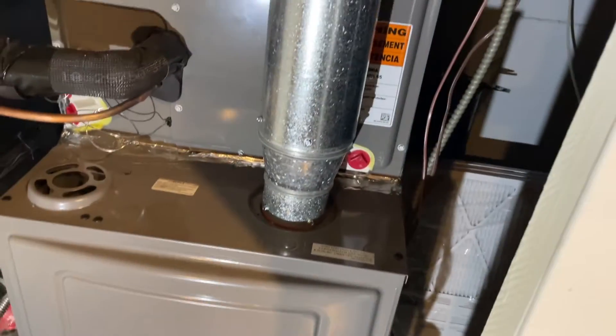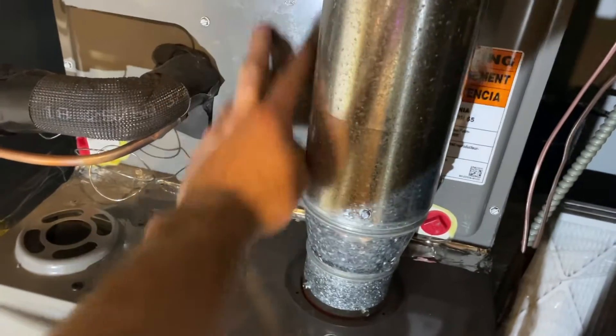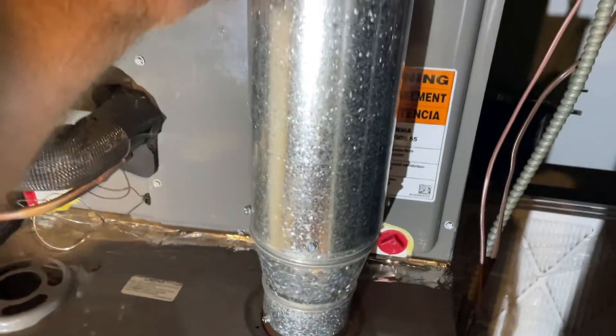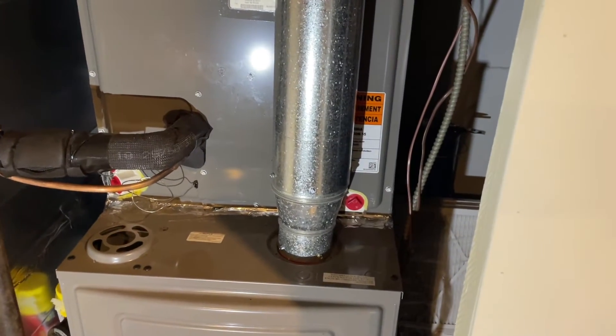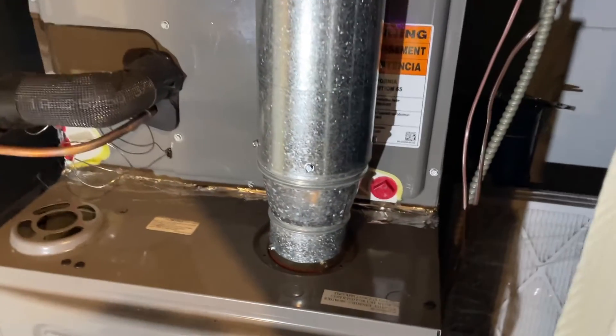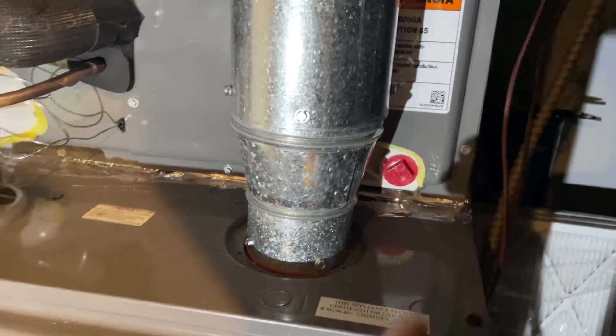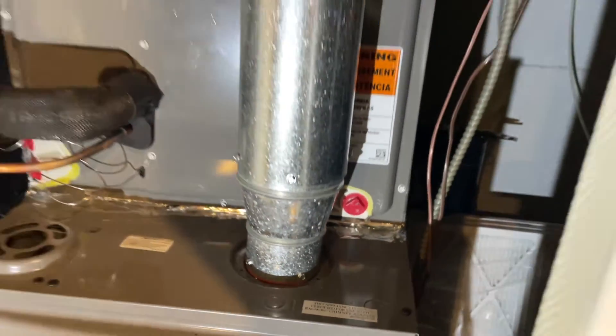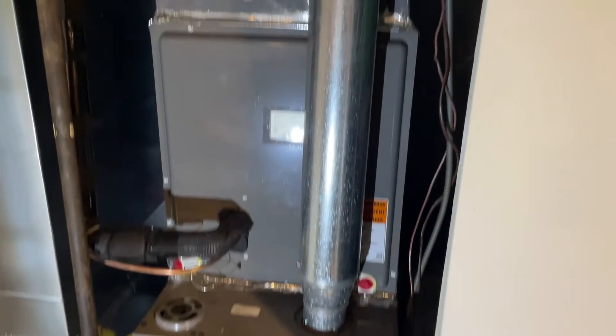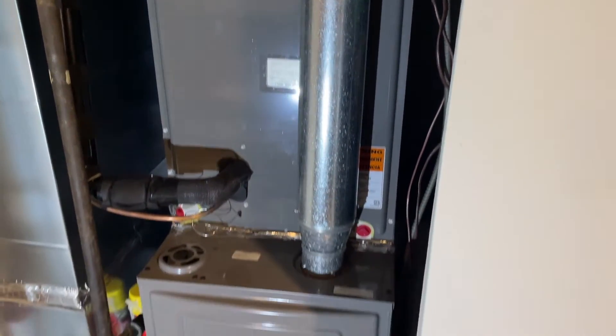The reason is your condensation drain line that drains the condensation liquid from your cooling coil in here — it's either clogged, which you need to clean out, or it's not installed. In this case, this is a new system installed over the winter; first time I'm running it, and I realized there is no drain installed. It should be connected right here, so that needs to be in there.